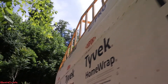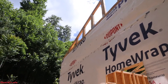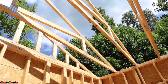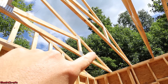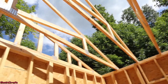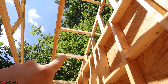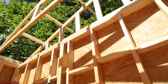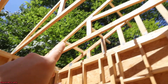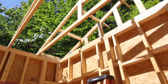The first thing I want to do is start over here and begin getting the boards cut for making the corner and getting those eave boards moved out. This truss right here goes up to this point, and this one over here is lowered by three and a half inches. That's what allows a two by four to span from this side on top of that one and out to the outside. So I'm going to measure from the end of this truss at two-foot intervals up to the top, and that's where those boards are going to be installed.